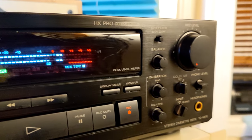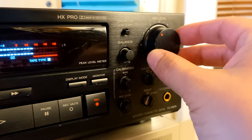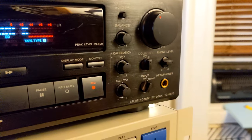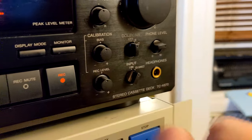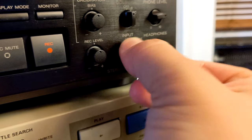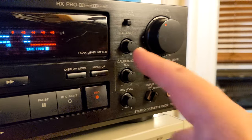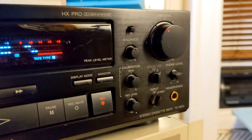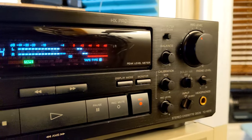Big recording level knob with a balance knob. And what is really interesting, of course besides Dolby B and C, and input level because you can choose line or CD direct — there are two line inputs on this model. But this is the interesting part: calibration, bias, and recording level. So it is a calibration, but you have to find your level and bias with your ears.